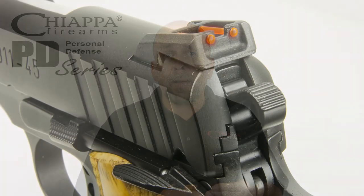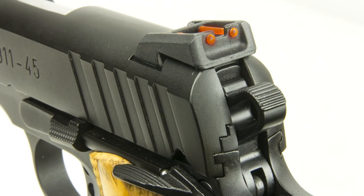When we went to the drawing board to design our new 1911-45, it took little effort. We simply designed a production gun that had many of the features that I always put in our custom guns. For starters, we chose a Novak-style polymer sight with fiber optics. The utilization of a lightweight polymer sight minimizes the weight of the slide, and the constant color of the molded front sight ensures that there will be no unwanted glare from the finish wearing off of a steel sight.